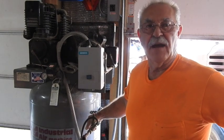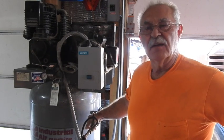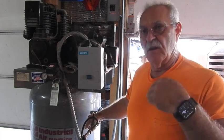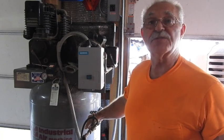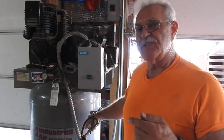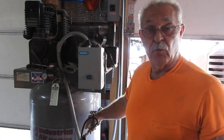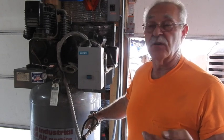It's really a good product, there's no doubt about it. But did you ever wonder what you do to check and make sure that the efficiency of the compressor is still what it should be? You can refer to that as volumetric efficiency, because you have to have a certain factor to determine whether or not it's worth continuing to run a compressor as it gets older. You can also use that to record over the course of years if the machine is wearing down to where it needs pistons, rings, valve plates, or whatever replaced.